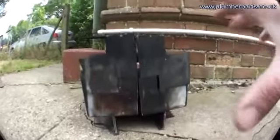Let's take a closer look at the primary heat exchanging baffles of this boiler. Right, so here we have the primary baffle area just here. Now remember, most boilers, especially quite old ones, the baffles are really just a metal plate, usually just about 3 of them. They're at a slight angle, 1, 2, 3, and then that flue gas goes off out to atmosphere, never to be gotten back again, often at about 250 degrees flue temperature. Having a look at these here, this is only the start of the heat exchanging possibilities.